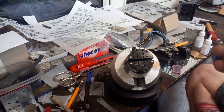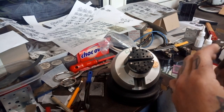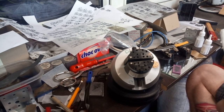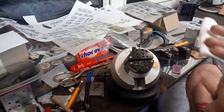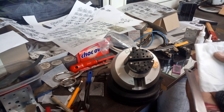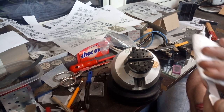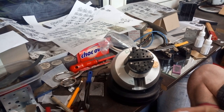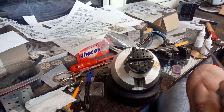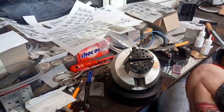First of all, just take a very small drop of acetone — a tiny amount, you don't need a lot — and clean the back side of the knife just a little bit. It should not have any fat, oil, or grease on it, because the hairspray needs to stick to it. If there's some dust or little debris on it, that's not a big problem.